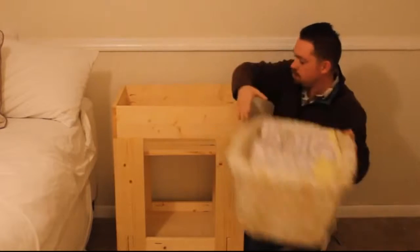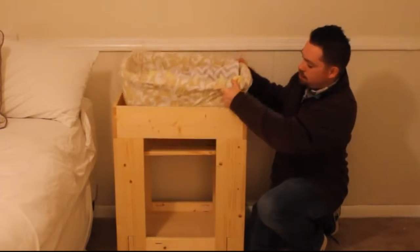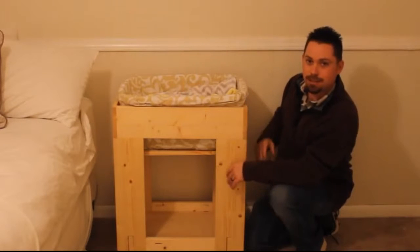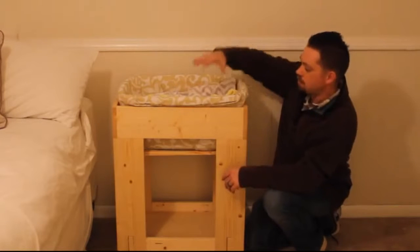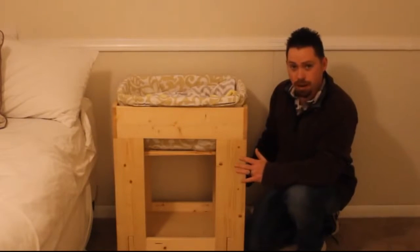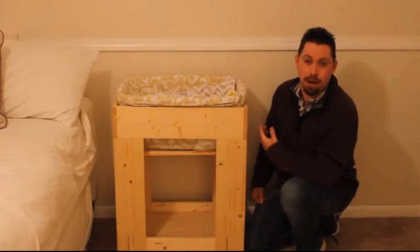So this thing just has two boards, two 1x6s that are a shelf that the weight of the baby kind of sits on. But I designed this frame, this bassinet, to catch the edges on all four sides. So just in case that shelf failed, then at least this thing here would be caught on the top edges of the framework. So all I used was pocket holes. I have a Kreg Jig and glue and the saw. I only used one saw, and that was my miter saw.